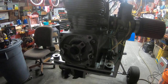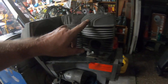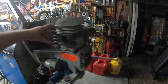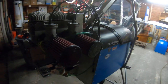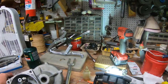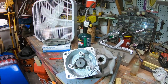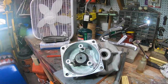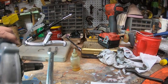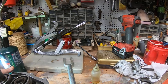On the other side, I did do a compression check on my engine. Both cylinders are reading right at 96 PSI. I talked to Michael over at Stol Craft Aviation — I believe that's the name of his business — and he told me he likes to see about 100. I'm at 96. I didn't see anything major inside the cylinders, and I took some pictures to put on Facebook later.